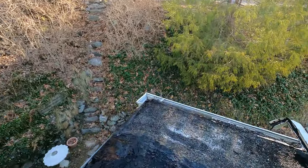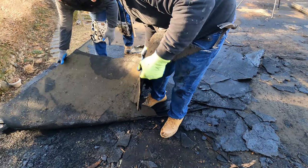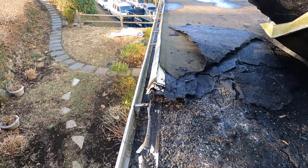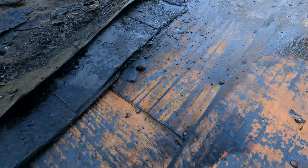It turns out I was actually wrong — this is the second roof on here. The original roof is the gravel built-up roof, and they put a modified bitumen layer on top of it, then a bunch of layers of tar on top of that. We can reference it from the three to four different drip edges down there. Let's get it ripped off. It's going pretty good, but the plywood on the other hand does look a little bit gone.